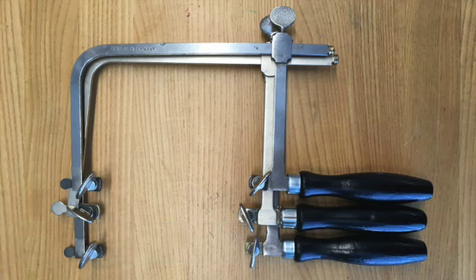The shallower frames are more stable, rigid, and easy to control, but they limit you to working small. As the frames get deeper, they generally pick up a lot of flex, which makes it harder to get the proper tension on the blade. The center of gravity also shifts further away from the handle, which can make them feel clumsy. The 4-inch frames supplied for the class are a mid-size that provides plenty of depth for most tasks without introducing too much flexibility or compromising balance.